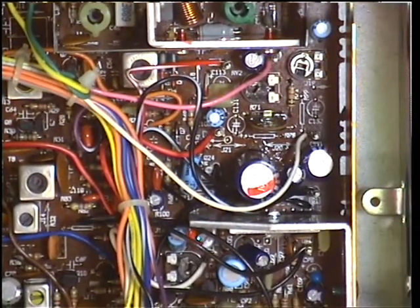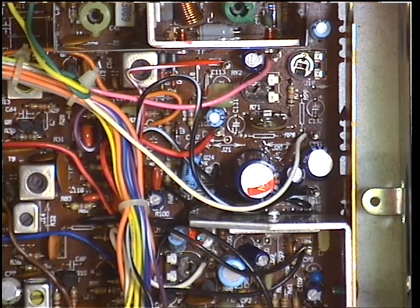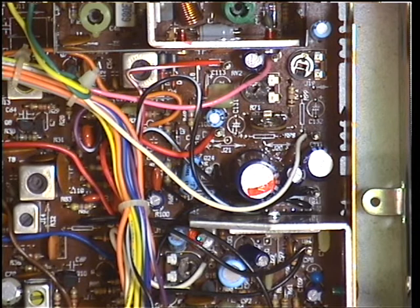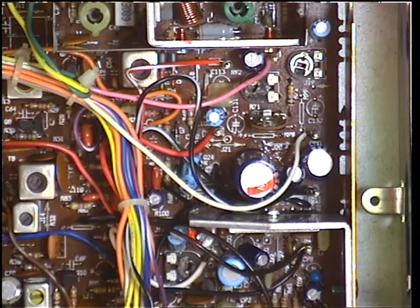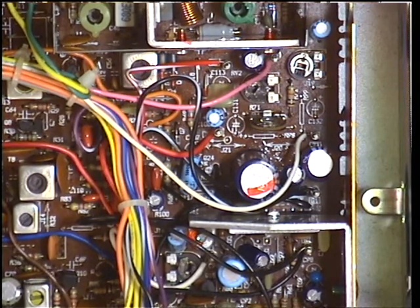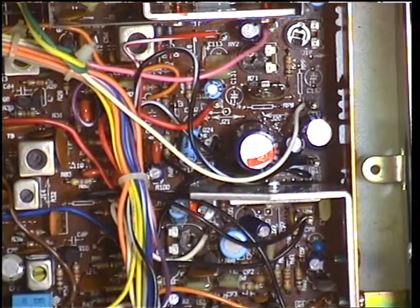It's so dreadful that we are going to go straight to adjusting the detector. I'm going to put it up to 100 microvolts equivalent signal, which is S9. I've got it on my oscilloscope screen — it is an awful trace — and transformer 12, I can't quite move the set far enough forward.